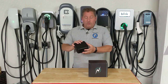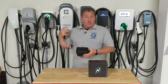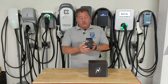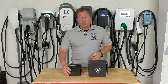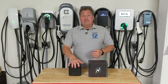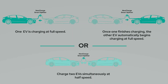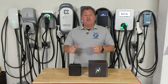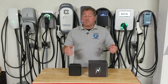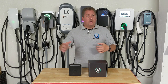You can get NeoCharge. What you do is simply plug this into your outlet — you probably have a NEMA 14-50 outlet where your existing charging station plugs into. You plug it in, and it has two NEMA 14-50 plugs on either side, so you plug in a charging station on both sides. NeoCharge will intelligently monitor and deliver power to one car at a time. It can deliver power to both cars as long as it doesn't exceed the circuit's maximum capacity. On a NEMA 14-50 outlet, it can deliver up to 40 amps. With two Teslas, you could set each car at 20 amps maximum draw.